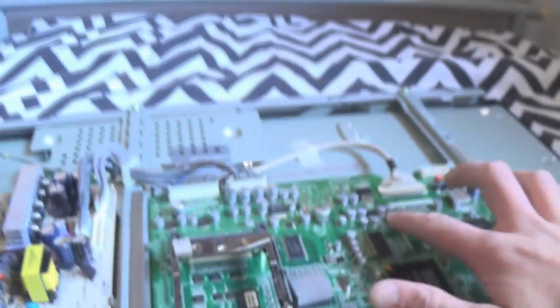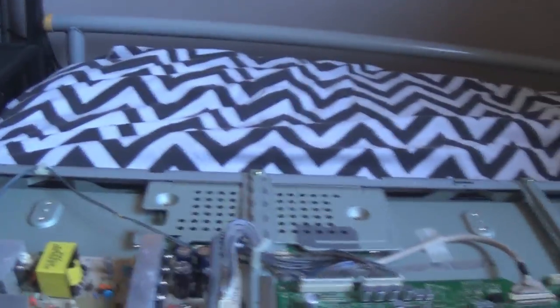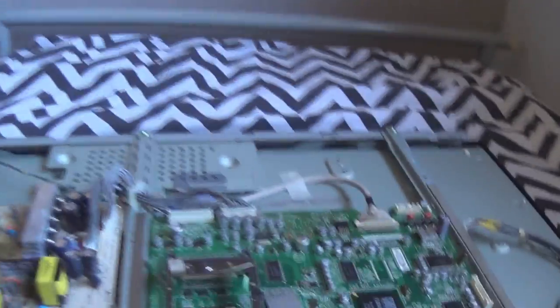Here we go. It only starts off minor, but the longer you have the TV on, the more it starts to fail. You see, the glitch that happens on the screen is not persistent. So it's not like a vertical failure. It's horizontal and it's all over the place. And the screen just failed. So, turn it off for a little bit, let it cool down, it'll come on fine.